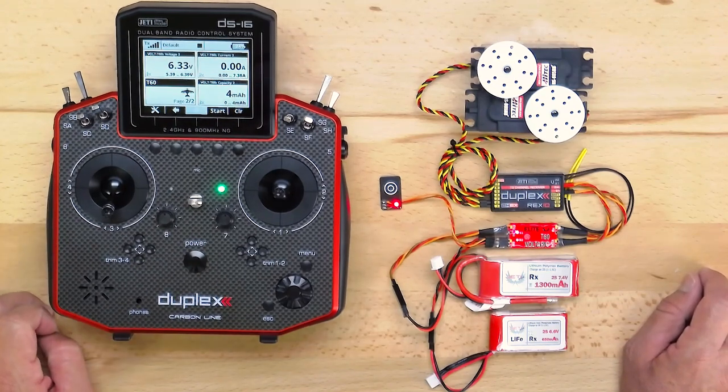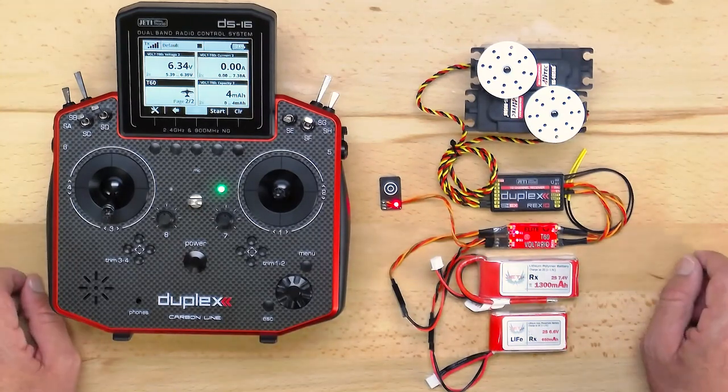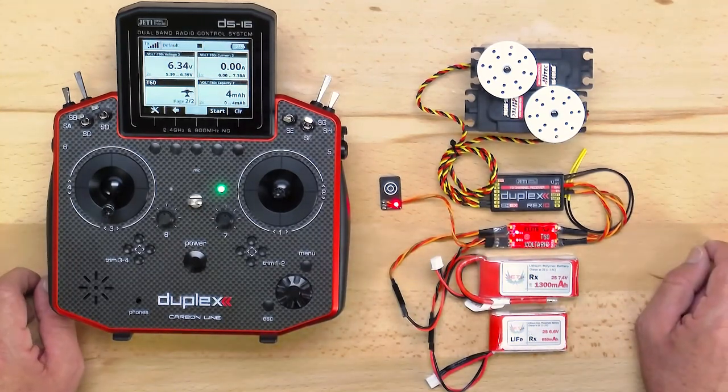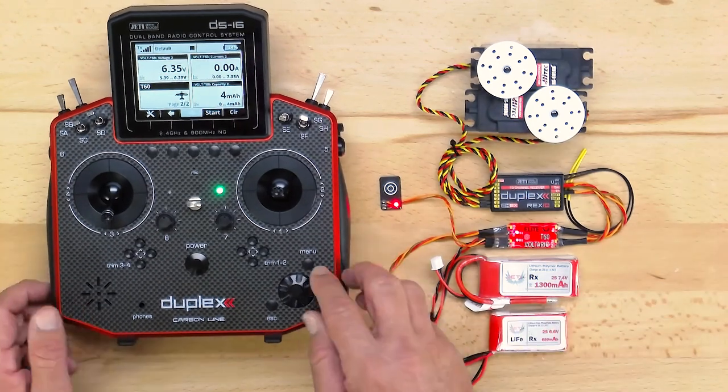If we drop out our primary power source — there we go — you'll see it immediately switches to two, and your amperage changes on screen right away to tell you you're now operating on that second battery input. As soon as you plug in your primary and it picks up that voltage, you're no longer going to be operating on the secondary pack. You are able to establish a switchover voltage — the point at which you want to switch from primary to secondary — and you're also able to set a charge from the primary pack to the secondary pack, even if those two packs are different battery chemistries.